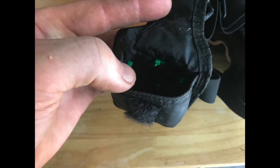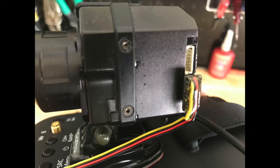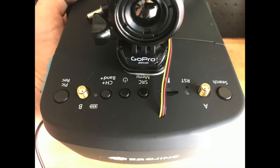The wiring going to the FLIR is the hardest part. You can buy the cable online — it's actually a GoPro video and power cable. But you need to make darn sure it's wired correctly for the FLIR, because the FLIR is not protected. If you get the wires backwards, you can burn it up. You can check the wiring diagram in the manual, look online, or I'll try to post a wiring diagram to this video.